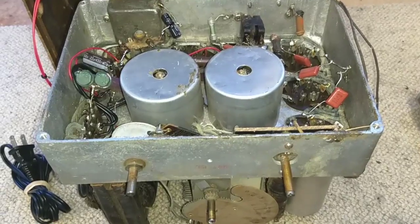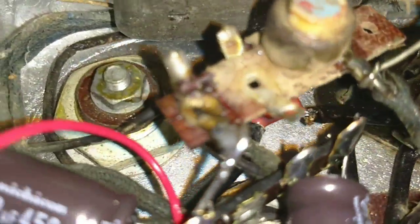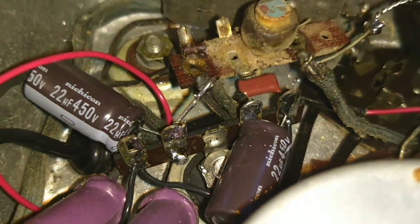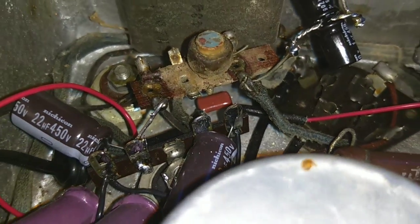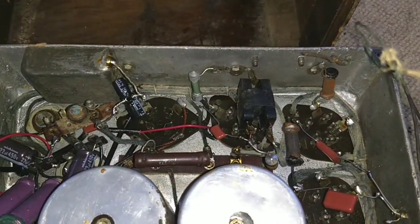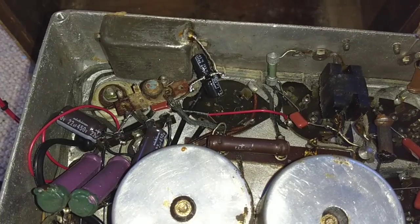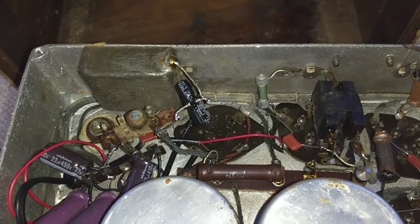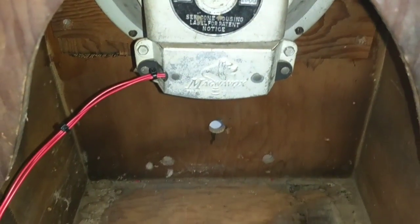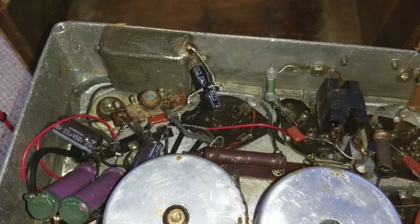In the diagnostic video we discovered there's an overload, likely on the secondary. Coming down to the rectifier socket and following things, the wiring looks correct on the schematic. So we're going to try to determine where the overload is. This number 280 rectifier is trash, so I'm just going to solder in some solid-state diodes for troubleshooting. If I get it working, maybe I'll consider ordering a tube. It's very likely going to be somewhere in the field coil or between the rectifier and the filters.